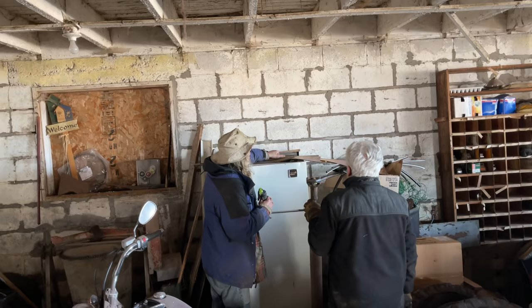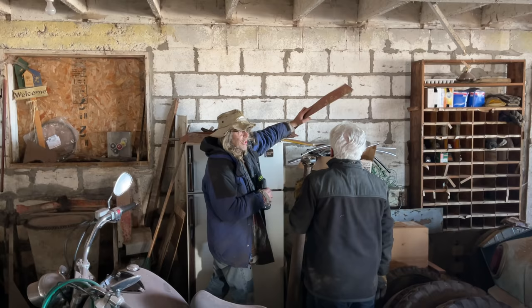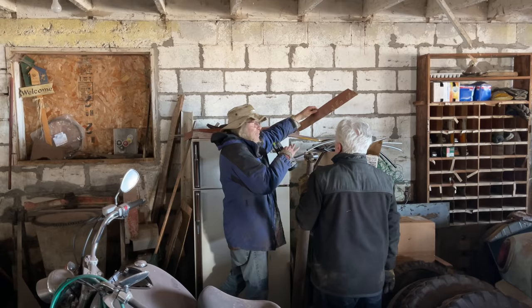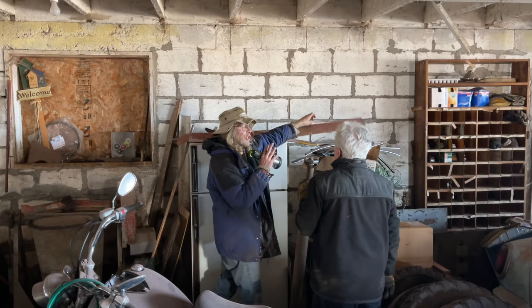This stuff works well for spacers, because it doesn't crack, like if you're doing repair work. I got some of it in the box because some of my headers going across weren't quite in the right place, so I've got a couple strips of that going across as spacers. But it is beautiful stuff for strapping boards in a house, because when you put a screw in a wooden shingle, the shingle cracks, but you just fold that over and stick it in.